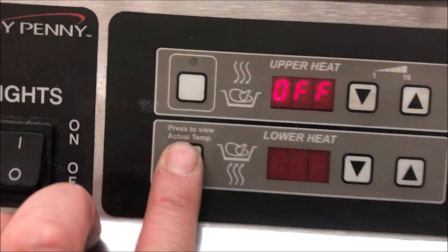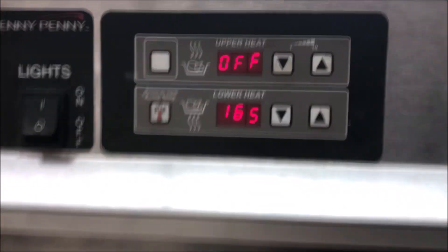Last thing: compare the temp. It's showing 162 actual temp versus a set point of 165 — we're off by 3 degrees, all good. It's very important to be thorough in testing to set point. When that upper element was down, I was thinking there's no way they'd shut the whole unit down for one radiant element being down, unless a health inspector came in. Because the call came in overnight, I didn't get all the information. But a good thing — I went ahead and was being thorough, checking things to set point, and caught that the board was failing intermittently. If I had not tested to set point, I would not have caught it.